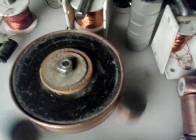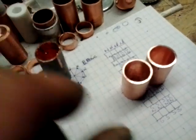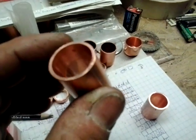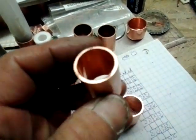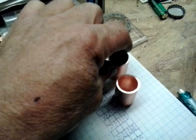So I'm thinking I'm going to build a prototype using the big rollers. I built a couple of new copper sleeves here that I'm going to load up with some ring magnets this time. Two made there — thirty-three millimeters long, nineteen millimeters on the inside, and they weigh thirty grams. So I'm going to load them up with some ring magnets — eleven of them to be exact.